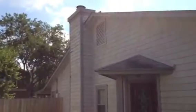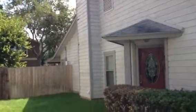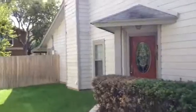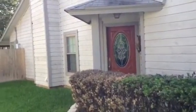I have a couple of gable vents, so those will be treated like a window. We talked with Mr. Knight about the trim and how we do that, how we cut our corners to prevent against any kind of water infiltration. They had some windows installed by Home Depot. They have all this aluminum coil stock around the windows, so that'll come off as well as the 1x4 trim.